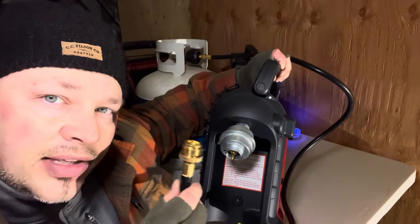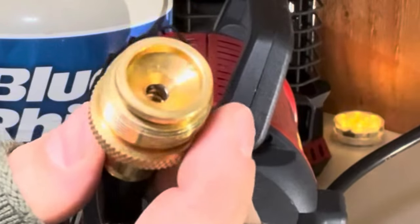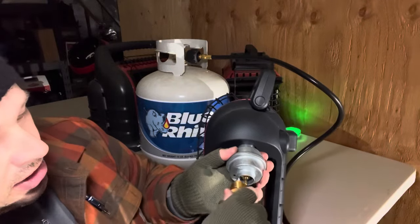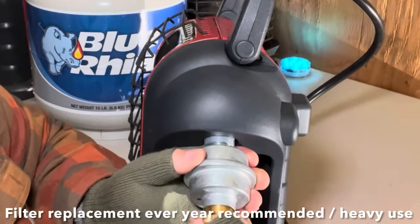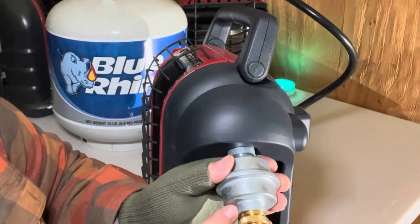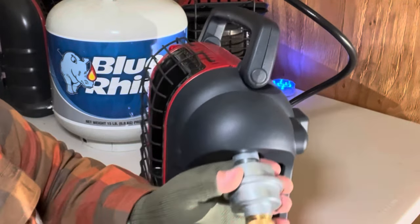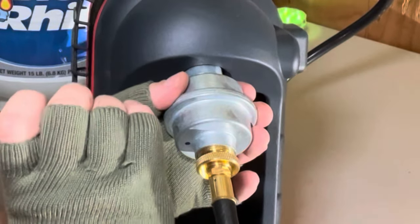Next, take this end of the hose — you can see there's liquid in the hose, but the hose won't restrict the liquid; the filter will. Same story: be careful on the nipple, go backwards a little to make sure it lines up. If it's a struggle you might be cross-threading it — back off and start again. Get this nice and fist-tight. If you hear gas, take a pair of pliers and give it a quarter turn, but generally hand-tightening is fine.